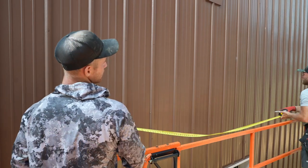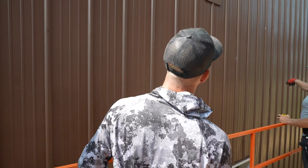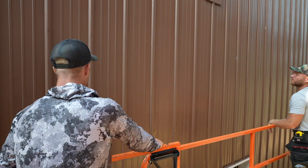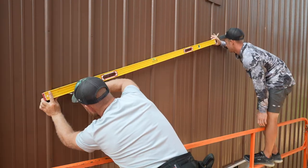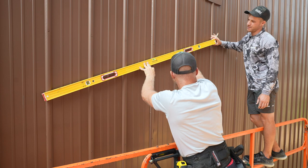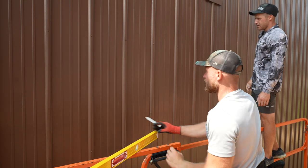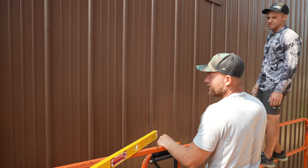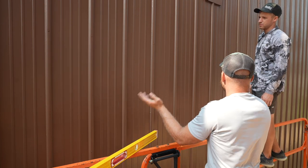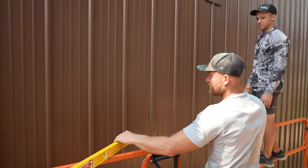All right, so now I can use those to determine where my points are. I'm gonna go up an inch and a quarter. So it's kind of nice that there's a girt here. So I'll have to frame here and it's gonna be fun cutting it out though. Tell me when. Yeah. All right, man. So that's what I'm cutting. That's what I needed you for. Now I just gotta figure out, that's my fascia. I'm gonna go past it another inch and a half for here. Yeah, then I can get this cut out. Get the trims here. Once it's blocked, get the trims there. Run our purlins. Easy.